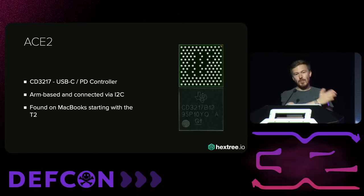Time to dump. My payload was not the greatest, so I could only dump four bytes at a time. It took hours, the battery ran out, I had to reflash, restore, recharge, glitch again, and then dump again. But eventually I had the full firmware — a full dump of the ACE3 ROM and RAM. So awesome — we can actually start reverse engineering this chip.